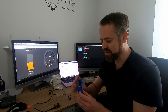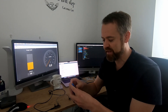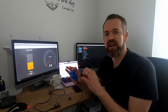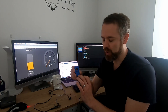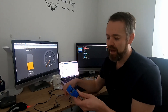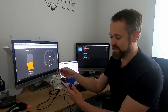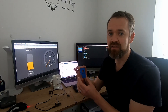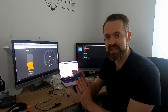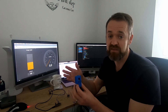If you buy a cheap one of these, it might not have a blocking diode or a burden resistor. The burden resistor is there to make sure things don't get out of control, and so is the diode. On one that generates an amp output, the burden resistor is important so you don't get a shock. This one has a diode built in, so if you unclamp it while working or it gets disconnected, the little transformer inside can build up quite a high voltage and give you a shock.